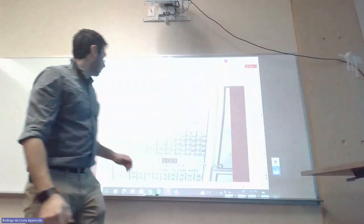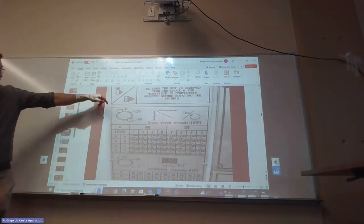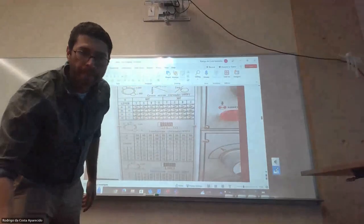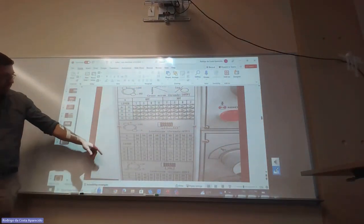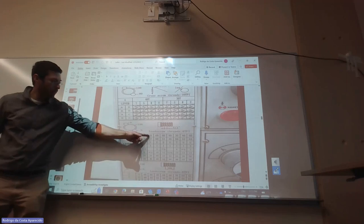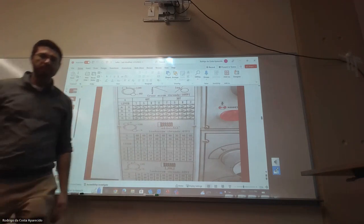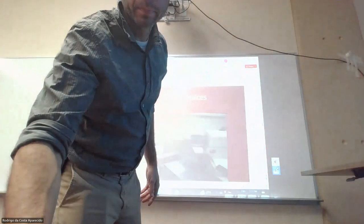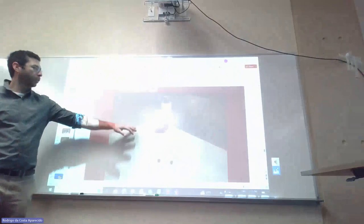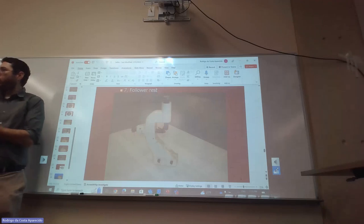We look at the gears inside of the gearbox, and you saw the drawer full of gears. That's so you can match the ratio. See here, on the bottom it says 60-60, you use this column; 60-40, 60-54, you use this column; 60-57, use that column. That's all replacing things; you just change the gear ratio. I also showed you the follower, something to give you some resistance on the other end, so when you're cutting, you're not going to push your stock back.